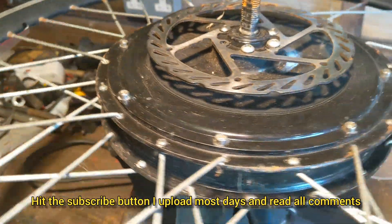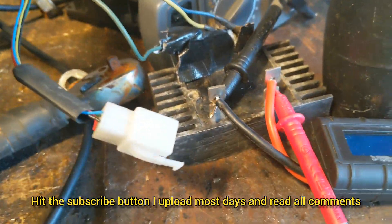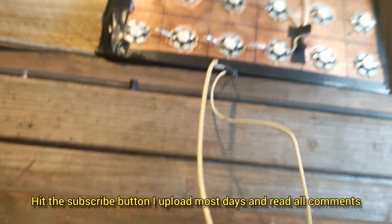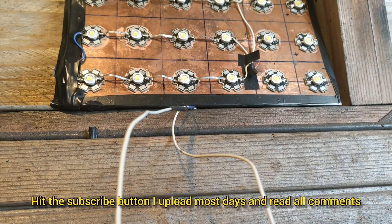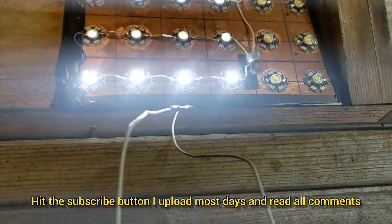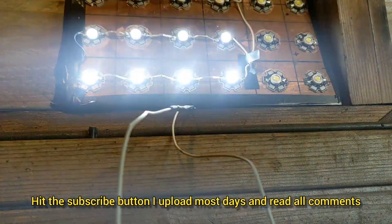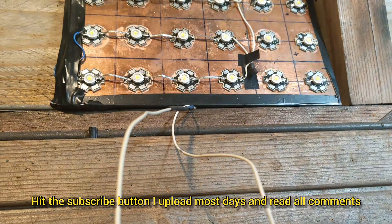Another video about what I plan to do with the turbine. I've got it set up through the rectifier and through this meter and to the LED. I'll give it a crank or two — so that's about one and a half RPMs. The meter is only reporting three watts, which I think is a bit off because I think the light needs more than three watts to do what it's doing. So I guess that's another way you can test it if you want.